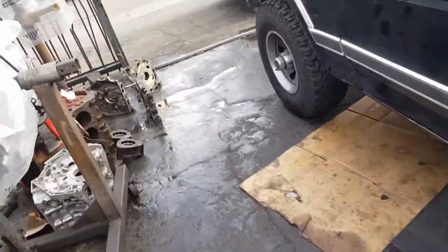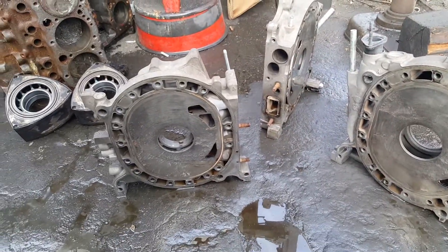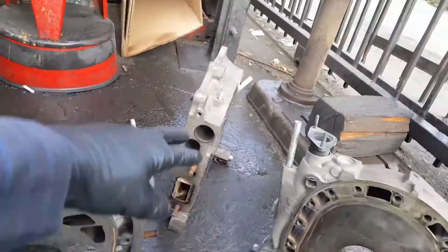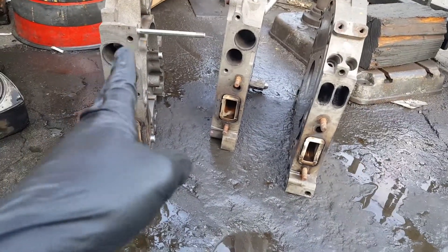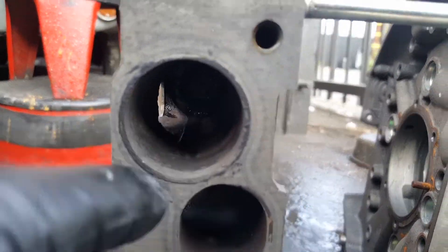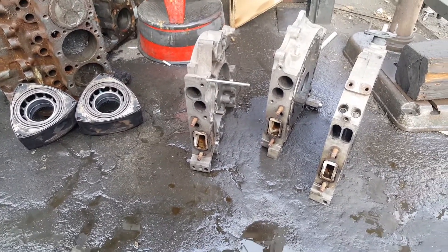This one is gonna go in for a rebuild. I took it out from the hot tub with the hot water pressure wash. I wanted to show you guys how you can identify whether you have a four-port or six-port — the easiest way is to look on the sides. See: two, four, six — that's the intake. That's where the intake ports come in. On the four-port, the top one is plugged; on the six-port it goes through. That's how it looks. Thanks for watching, stay tuned!